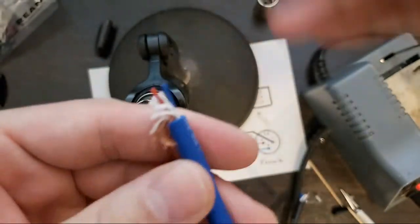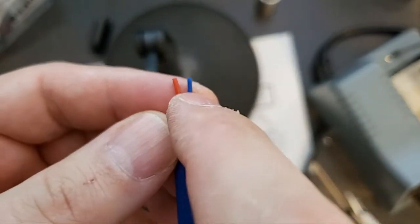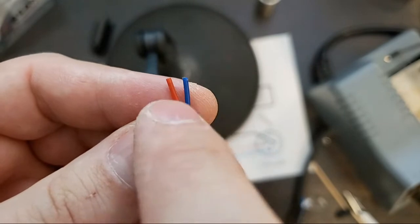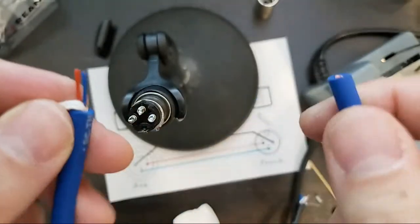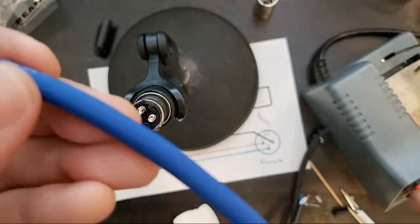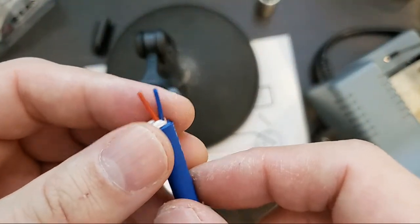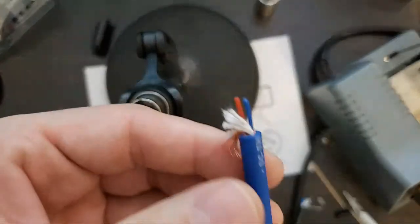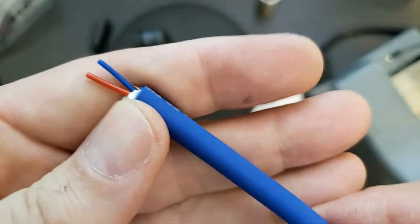However, on a two-conductor cable, the hot cable is 180 degrees out of phase with the cold cable. So it's essentially the same signal doubled in exact opposite phase of each other. By the time they both get to the other end of the cable, inside the equipment, the signals are reconnected. And they reject all of the interference that is picked up by the cable, because these pairs are twisted around each other. That's called common mode rejection. So the idea is, if these two cables nearly share the same space along their path, the closer they are together, the better they are at rejecting signal.